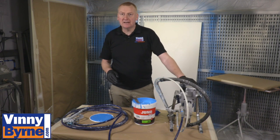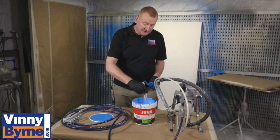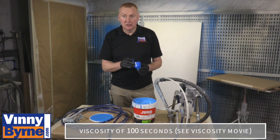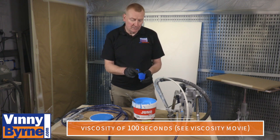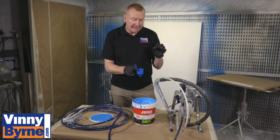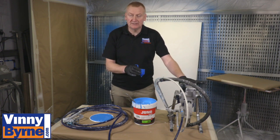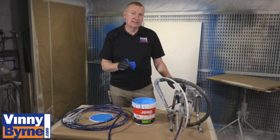Today we're going to use an airless sprayer to apply it. With the viscosity — that refers to the thickness of the paint — with the Aristo Spray Cup we're measuring about 100 seconds. When we fill that up with paint, release it, and have a stopwatch going, it'll register around 100, which I found is quite decent for spraying with. That viscosity will vary with temperature and with whatever machine you're using, so you'll need to adjust it, but it's a good idea every now and again to check the thickness of your paint.